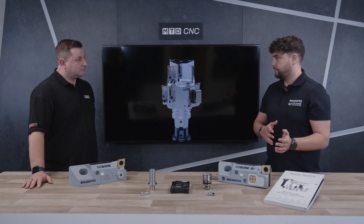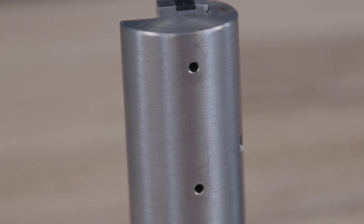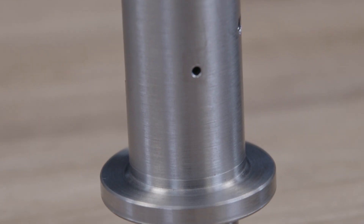What sort of sizes do you do in step boring bars, and can you make one specific to my application? Sure — for these cartridges we start at diameter 28mm, and if you bring us your drawing of your component we can make the tool exactly as you want it. The cartridges can be adjusted in an analog or digital version. Also importantly, the cartridge is a standalone product — you can create your own tool body at your company and just buy the cartridges to get Wohlhaupter accuracy. So you offer a solution for any sort of boring problem? Yes, we do.